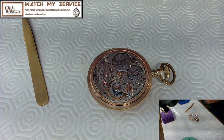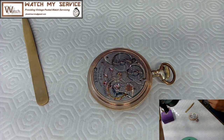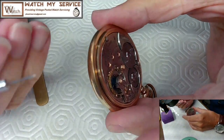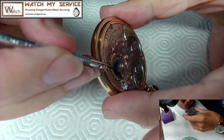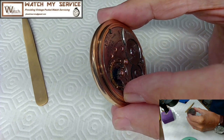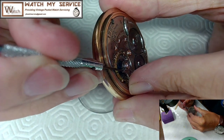I don't get a lot of views, which is a tragedy — guys like Wristwatch Revival and Just One More Watch get tons of views. Anyway, when you're doing this you have to be very careful bringing your screwdriver up to the movement: get the right blade and make sure you're not at risk of slipping into the hairspring. I need to dress my screwdrivers — that ensures the blades are flat and at the right angle so they sit properly into the screw.